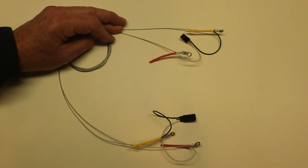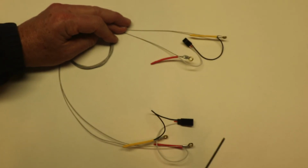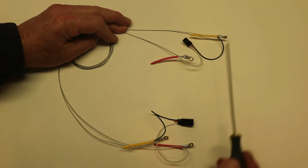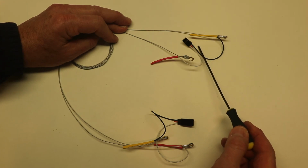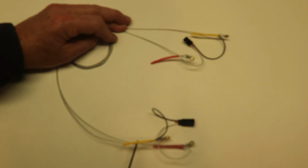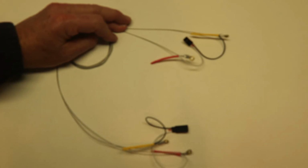So in other words, your down the line electronic device, whether that be a servo driver or a modified transmitter or whatever it may be, can plug into the end of the lines or it can plug in directly to the airplane. Either way, the type of connector you have at the airplane and the type of connector you have at the handle end need to be the same type. Now, I was able to measure the ohmage across these two wires and figure out that this wire goes to the black and this wire goes to the white. And that's just measuring the ohmage between the two wires.